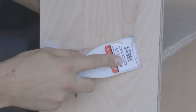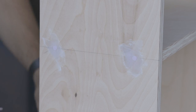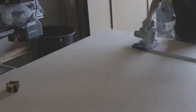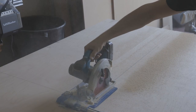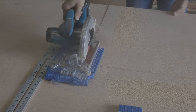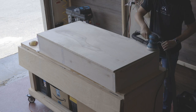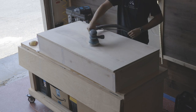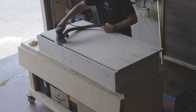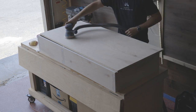As I already mentioned, all the screw holes I'm filling in with a wood filler. This panel is a drop-down desk. Size is 52 by 25 inches. I'm sanding down both sides to get a clean and smooth surface. On this panel, I will apply edge banding. Since this will serve as a desk, I want the edges to look clean instead of having a plywood pattern on them.